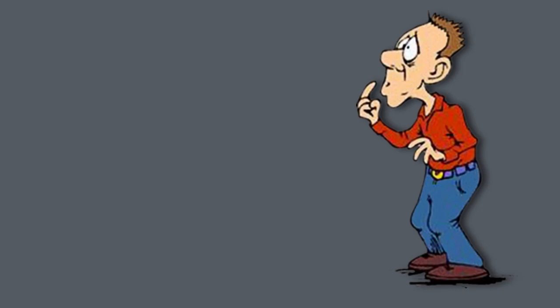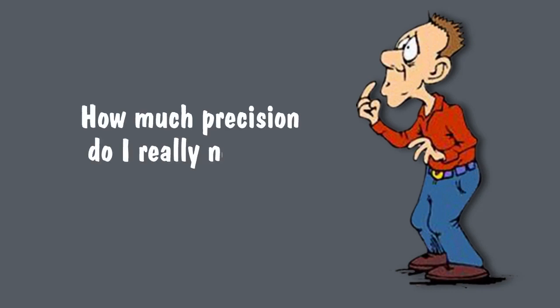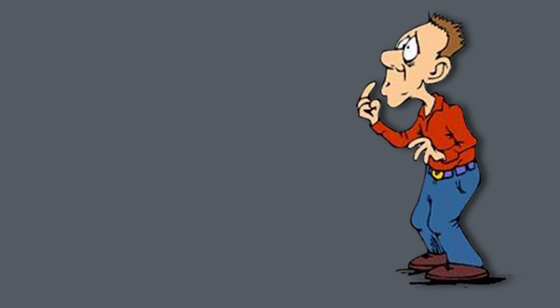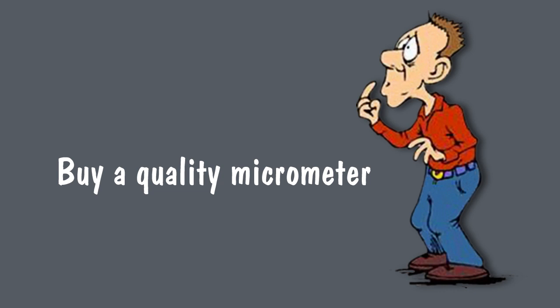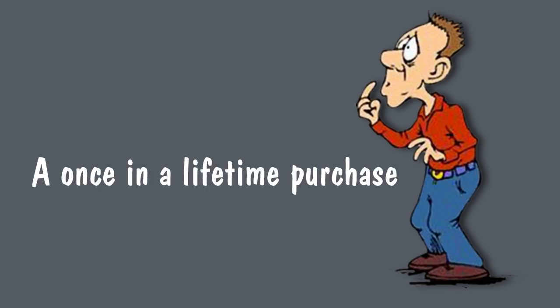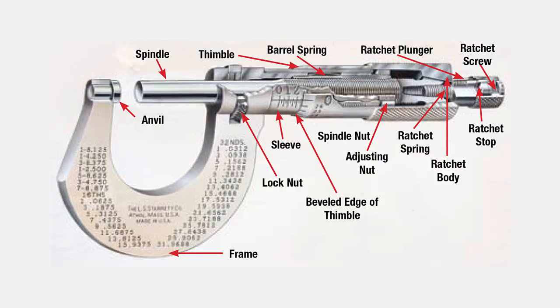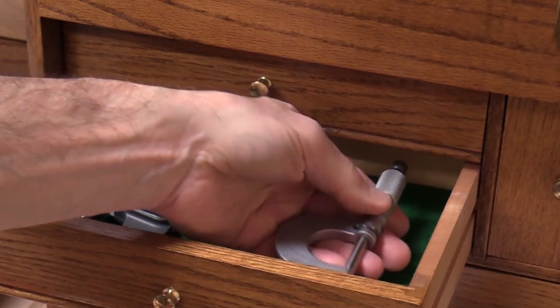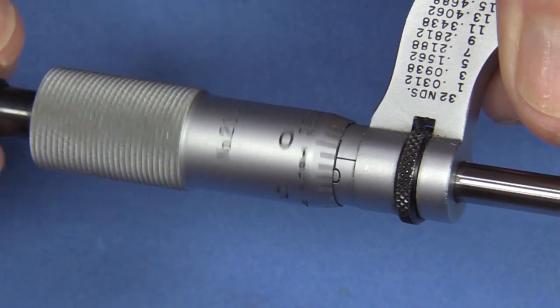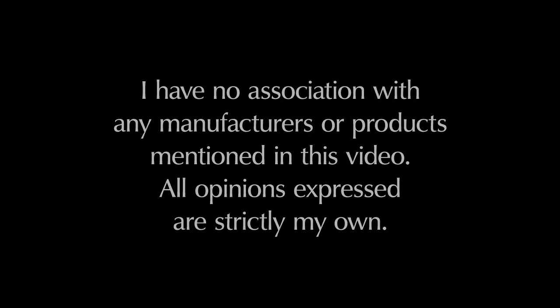These are just a few examples, but basically it boils down to the initial question of how much precision do you really need for what you're doing? There's no disputing that the micrometer is more precise, but do you need that precision? Finally, as with any measuring tool, buy a quality micrometer. Any measuring tool that returns inaccurate or unrepeatable measurements is less than useless. If you take care of it, a good micrometer will be a once-in-a-lifetime purchase. Keep your micrometer clean, especially the contact surfaces of the anvil and spindle. Before I put any micrometer away, I make sure the surfaces are clean by pulling a cloth — usually my shirt — between the two, and I double-check by closing the mic and confirming that it returns to zero with the action of the ratchet. If you live in an environment prone to rust, watch for any corrosion of these surfaces. I hope you found this video informative, and I look forward to seeing you next time.